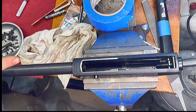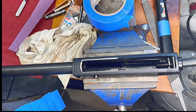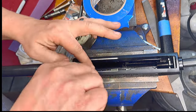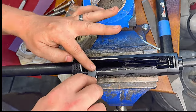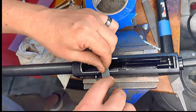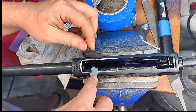Now we're gonna come in here with some sandpaper and clean this up. I'm gonna use it on a file to give it some backing. This is aluminum, so it cuts pretty easy. I feel like we should round this bit because when you run your finger in there, it's gonna catch on the edge of this hole.